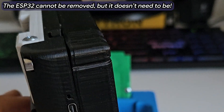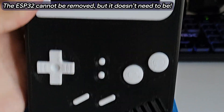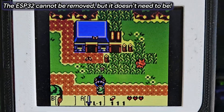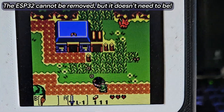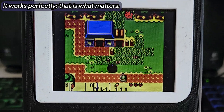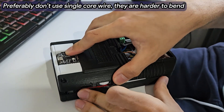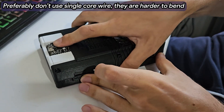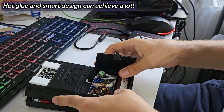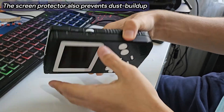After verifying that the removable cartridge concept wouldn't really work, I redesigned it so an ESP32 board could be soldered directly into the cartridge slot. This way, all instabilities in data transmission disappeared. Of course, this means the design isn't exactly modular, but after spending time with the console, I'm not sure that would have mattered anyway. For assembly, some things are secured with screws and some with hot glue. The case folds together and is assembled with six screws. Since the screen is plastic and easily scratched, I also recommend adding a screen protector — cut carefully from a larger sheet with scissors.